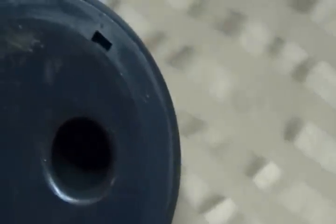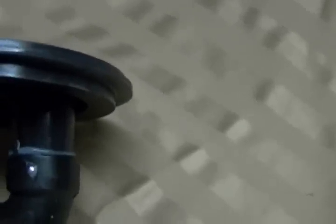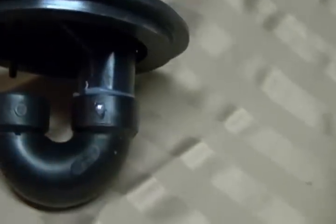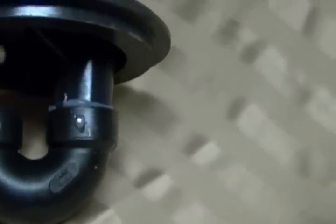If there's any excess water going into your basement from the hot water tank or whatever, it's going to go down this tube, so you can always drain excess water into your floor drain. It keeps it sealed with a little ball and a U-pipe.